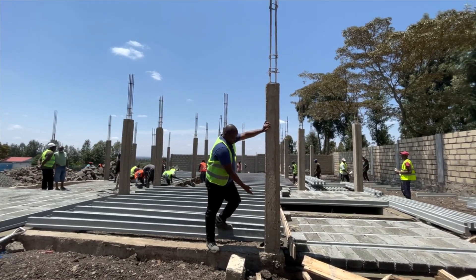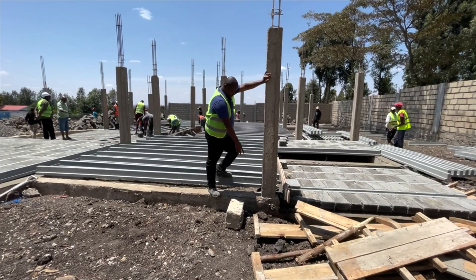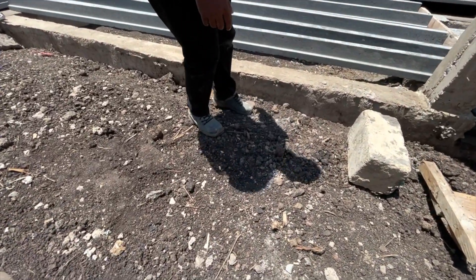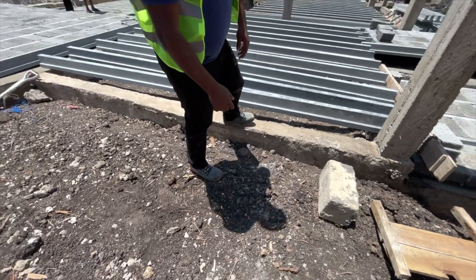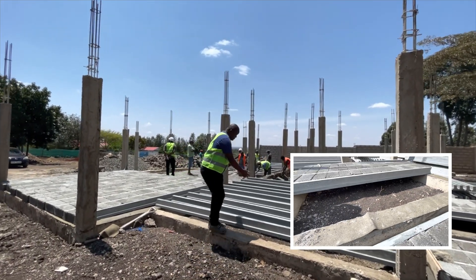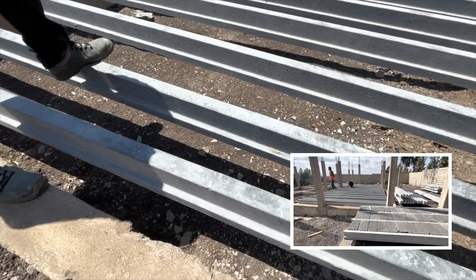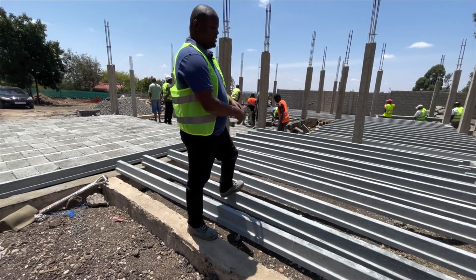So we dig to that point. And when we are off the cotton soil — you can see we are off by just maybe a foot or a foot and a half — we introduce this, it's called a ground beam. When you do the ground beam, we're able to put our products on top. This is the beam-to-beam flooring sitting pretty on it. But we have the soil underneath here. So when it heaves — remember the characteristic of cotton soil: it heaves and expands — when it heaves, it will not reach our foundation. So this is the cost saving here.